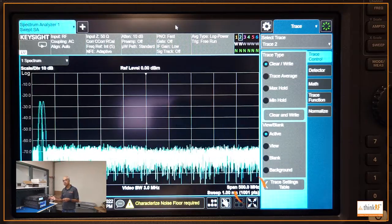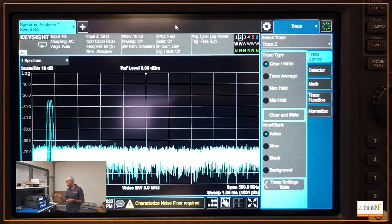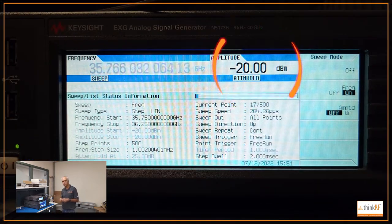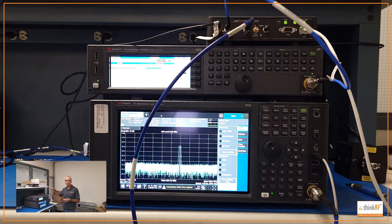We've got exactly a 500 megahertz bandwidth around 35 gigahertz. That signal is a CW signal swept across that frequency range, feeding the RF input. The IF output is connected to a spectrum analyzer set to a span of 500 megahertz, so you can see the signal sweeping. The signal is set to minus 20 dBm input. There's a front-end attenuator in the D4000 that's set to 0 dB, with the option to set it to 20 dB to withstand strong signals in the field.